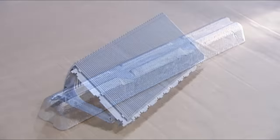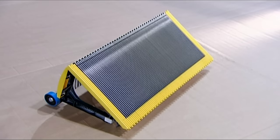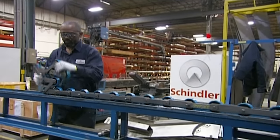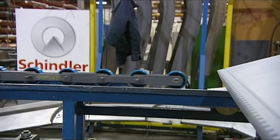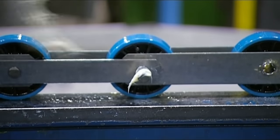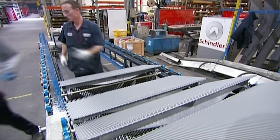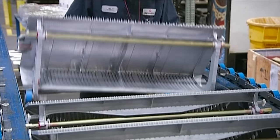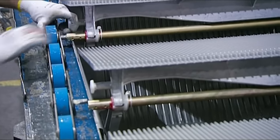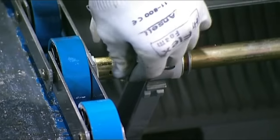Transformed from solid aluminium to a casting that is painted and assembled, the step is now ready to be installed. A worker rolls out a chain of rollers called a step chain, greases all the pins, then they place all the steps into position. Workers then connect the axles on the steps to the pins in the step chain and lock them together using a spring clip.